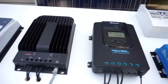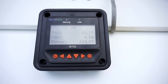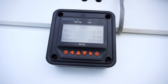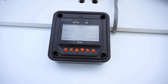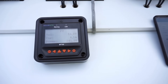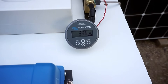Now the Outback Power. The voltage is sweeping through, tracking the maximum power point. It's taking a little bit longer, ramping back up. Reading 296 here, and 337 on the other monitor. So it's roughly settled on 56 volts as well, and 340 watts — also showing 336.